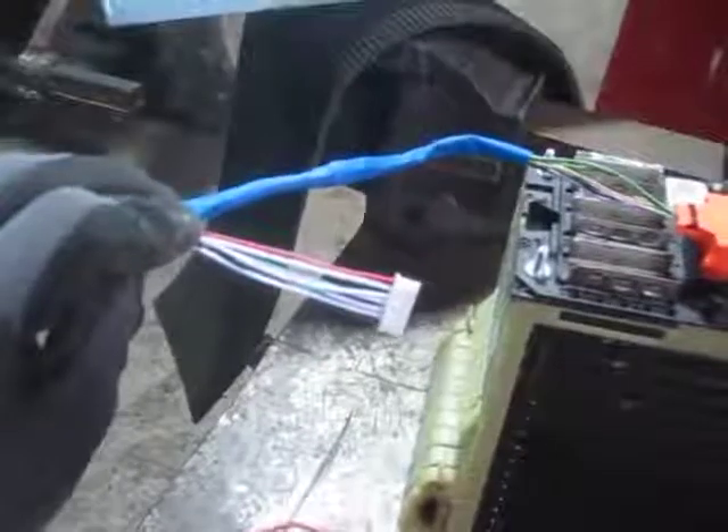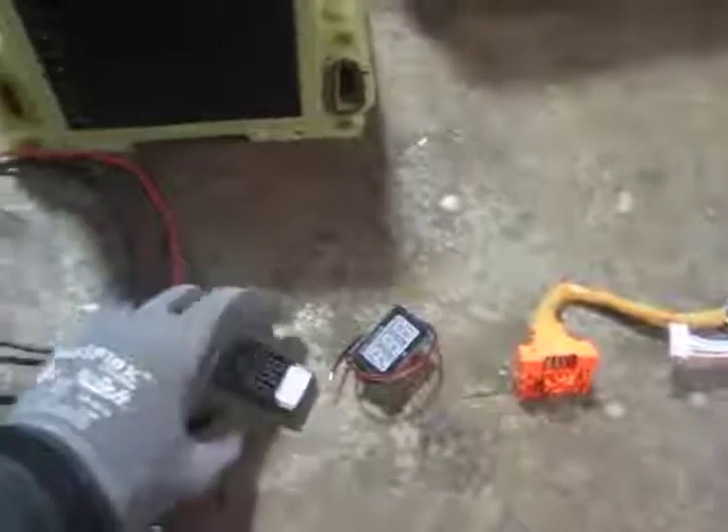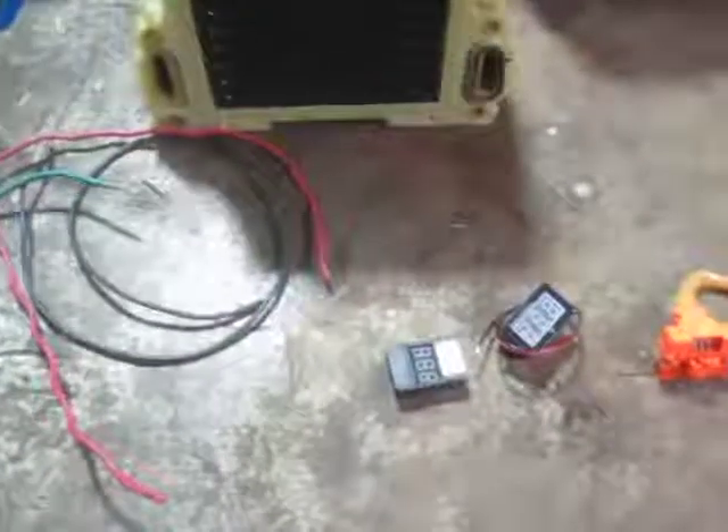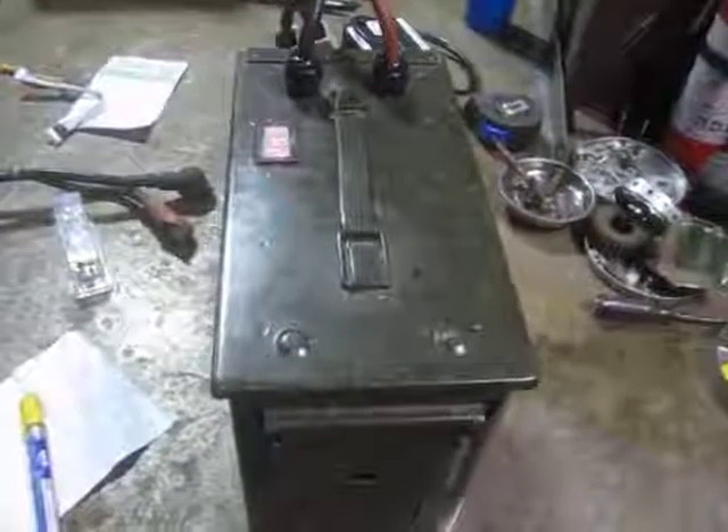I have all six of my cells, and I can run a balance charger on this with the main 24 volt, so I can balance it in the box. You'll also need a little voltmeter — these are waterproof, about $4 or $5 a piece. I also bought these little buzzer alarms, also from the RC world. They let you set a low voltage threshold so that when this battery pack gets down to a critical value, even if the operator isn't watching the voltage, the buzzer alarm will start screaming at them to stop using the battery and charge it. That seemed like a handy thing — again, about $4 or $5 ordered from China.